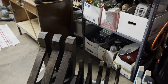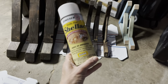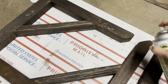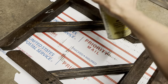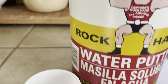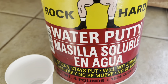I do want to seal the stain up to protect the wood, but also to keep the stain from bleeding through when I paint. So I'm using Zinsser spray-on shellac. I give every corbel a couple of really good coats — it does dry fast, but I let it dry all overnight so it's ready for paint the next morning. The next morning I decided I didn't like the way the screws looked, so I grabbed some Durham's water putty. It's super simple, easy, and quick. I mix the powder with water and just wipe it on — it dries quickly and I can paint right over it.